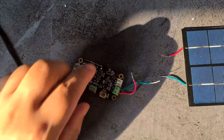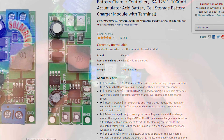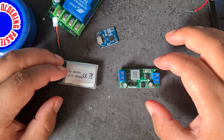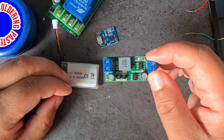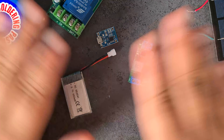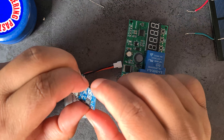I've already used one controller, so now we have two remaining. After some googling, I found that this charger is a 3A 12V lead-acid battery charger. Using a LiPo battery with it could actually be dangerous, and there's no option to turn the voltage down. Putting 12 volts into this setup would be a very bad idea, so I'm putting this charger aside and will do a separate video on it later.